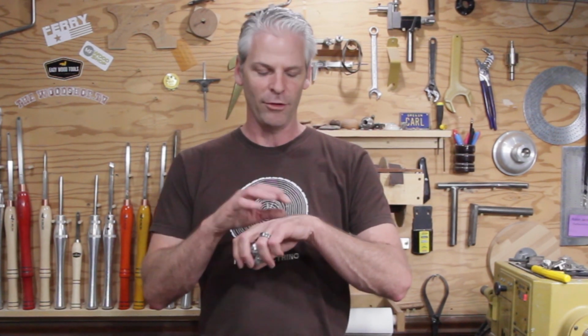I've turned a little bit of aluminum before, but just solid pieces, and it turns well. It comes off in little ribbons, just like if you were drilling it on the drill press. But I started out with the bowl gouge and it popped a couple of the little rivets out. And I think because it's getting the epoxy hot, the little shavings coming off were burning my hand. So I think that's what was going on.